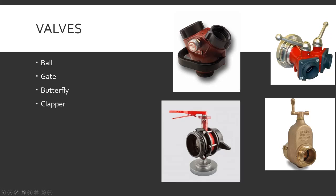You can tell the butterfly valve position with the handle — if the handle is parallel and in line with the pipe, it's open. If it looks like a T from above, it's closed. This one looks either open or partially open because it's turned a little bit and not straight either way.